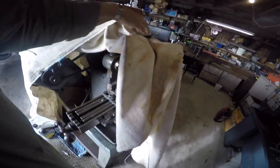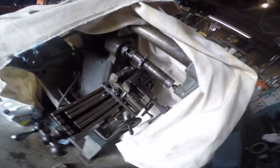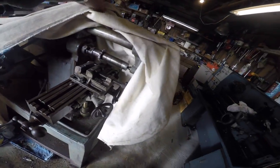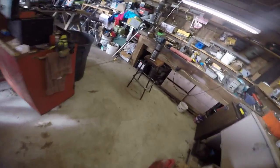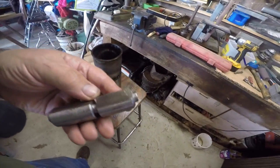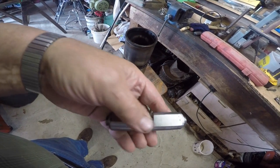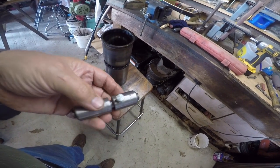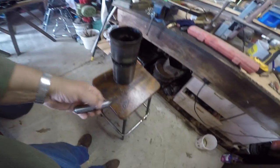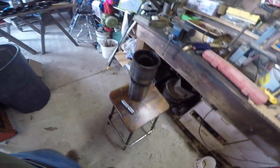We made it here on this turning lathe and then on this little milling machine — I keep it covered up, it's little but it does real good work. It took me a long time because I'm really slow at stuff like this, but that was just an old rusty piece of metal last week. I milled it down flat, turned it, and bored it. It works real good — it pushed those liners out with no problem at all.